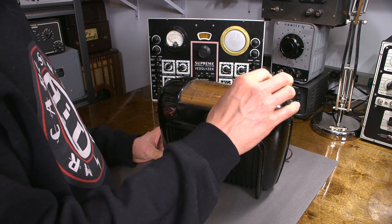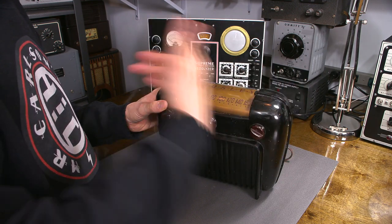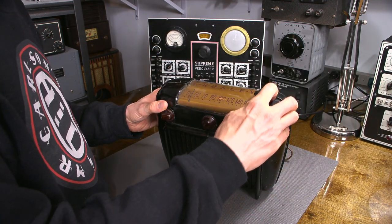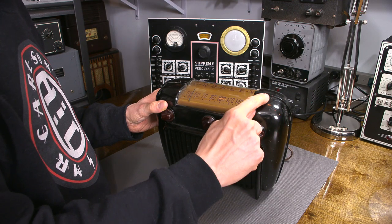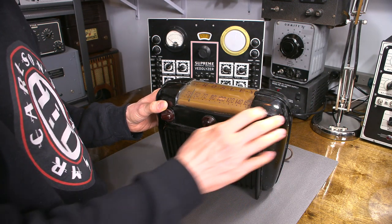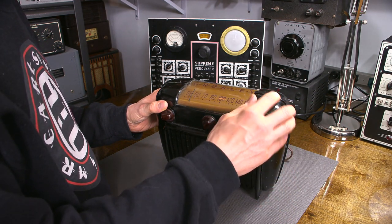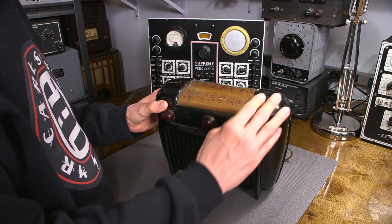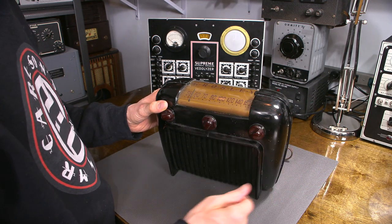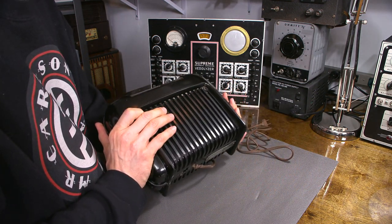What happens is this little Bakelite usually has pits in it, and when they paint the thing white - which it looks like it was painted - there are little pieces of paint in the pits. Those little pits are pretty deep so you can feel them. It's likely going to be quite a job. I'll probably have to take a gentle, not really abrasive, but a gentle scouring pad and go over this and then polish it up again.